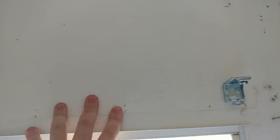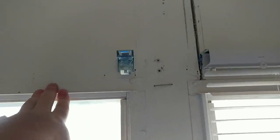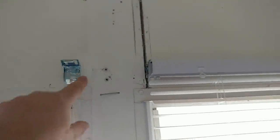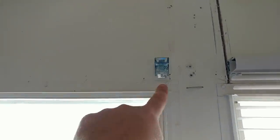I have a little trick for doing these. I didn't have time to do it today, but I'm going to do it later. First, you sand this off a little bit so you get to the sub-material — I think this is sheetrock based on how easily the screws went in. What you do is glue a little furring strip along the whole thing using liquid nails, about one inch thick, glued the full length. Then you can screw these in anywhere you want, and that glue has enough surface area it'll never let go. So I'll redo these later like that.